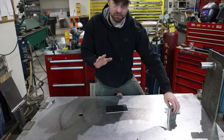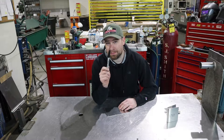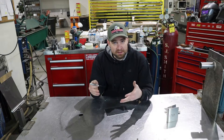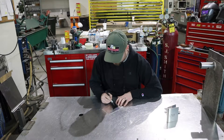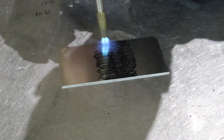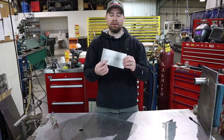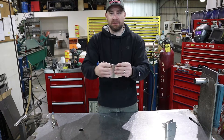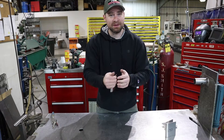Now I'm going to show you a couple different ways you can anneal aluminum. A lot of people have asked about the scribbling marks on the aluminum — that is Sharpie. You can use Sharpie and a propane torch, heat it up, and soften it. I'll also show you how to use an oxyacetylene torch to do your annealing. I'm going to do the annealing process in fast-forward mode, then come back and show you how easy it is to bend after. I've got the piece I just annealed — I let it cool down. This will show you how easy it is now to bend that same 6061 aluminum. It almost gets it to about the 3003. You can get it softer too if you put more heat into it, but that's what annealing does — it makes it really soft.